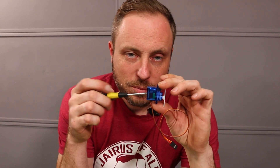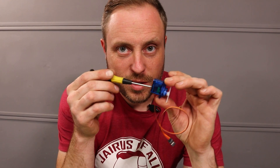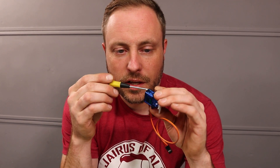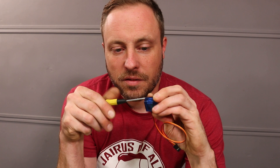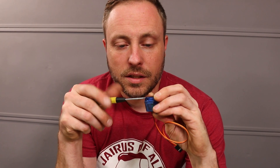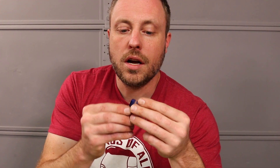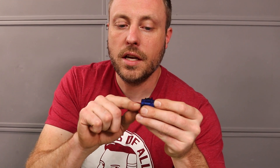This is a servo — it's gonna move the fingers. I could run a microcontroller to tell these where to go and make the fingers do all kinds of fancy stuff, but it would be easier and faster for me to just take them apart, pull the board out, and wire directly to the motor so that whenever the thing gets power it just spins indefinitely and makes the fingers move. I need to notch the bottom so that the wires don't come out the side — they can come out the bottom and swing back to the side so I can stick the servo down in easily.